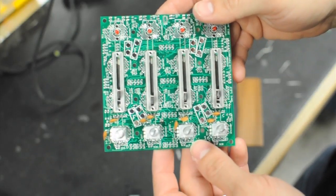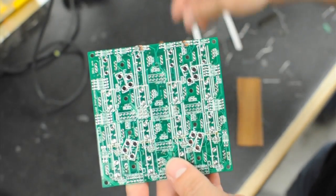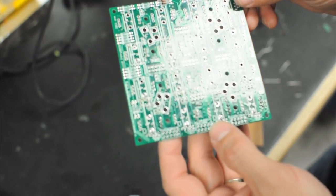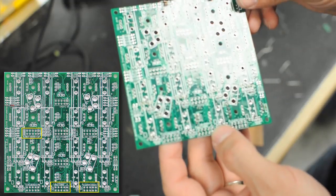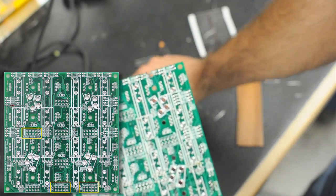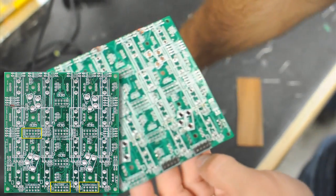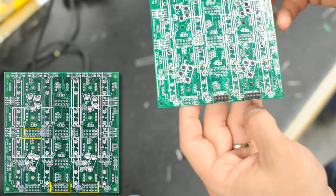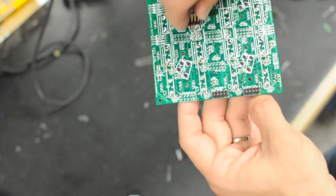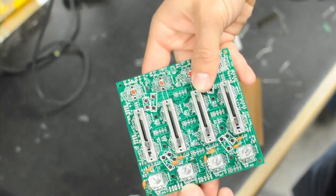After you have all your components in, go ahead and populate the pin headers. The pin headers are how you connect each Omniboard to the Brain. For this specific configuration, locate the button/encoder row 1–3 and put your 10-pin header. You're also going to want to do the LED matrix header since we're using LEDs. Finally, populate the slide pot 1–4 and pot 13–16 header for your sliders and rotary pots. Put these headers on the bottom of the board and solder them from the top.